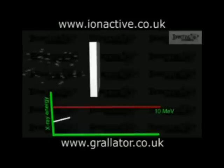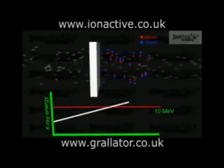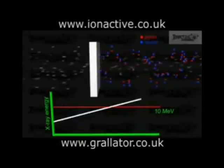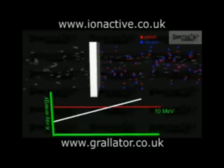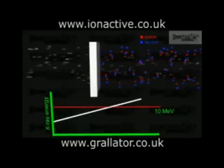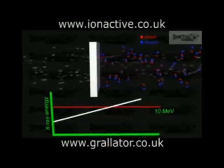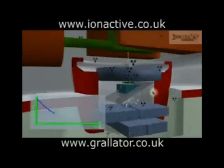When the LINAC is used as an X-ray source for photons above about 10 MeV, the photons can be absorbed by the material in the treatment head, activating them and releasing neutrons or protons. This reaction has a threshold energy so no activation is seen for X-rays below about 10 MeV. Any neutrons produced contribute to the dose delivered to the target or patient, while any protons produced are usually absorbed within the treatment head, leading to little or no extra radiation hazard. The activated materials in the treatment head can deliver a dose to staff dismantling the head for set-up and maintenance. The activated products are usually short-lived, so any radiation hazard during dismantling can be reduced by waiting several hours after the last irradiation. Because of the short half-life, it is unlikely that a significant build-up of activated material will occur.